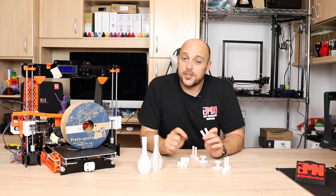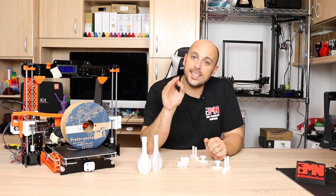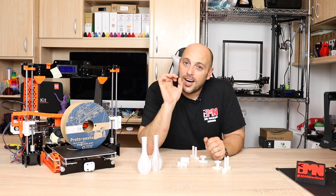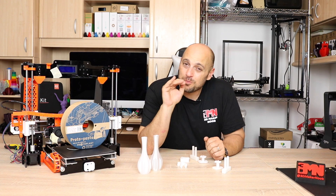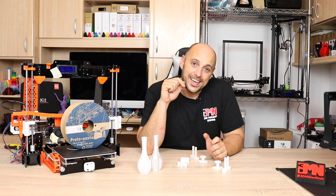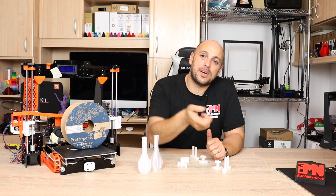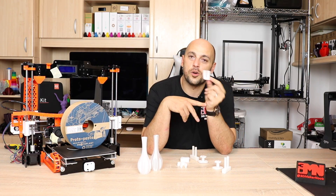The first time I tried cooking them I did it all wrong. The whole process is you throw them in at 100 degrees Celsius, but my oven is a bit inconsistent — it was about 130 degrees. I threw them in when the oven was still cold and then took them out after about half an hour, and the result was a lot of warped parts.